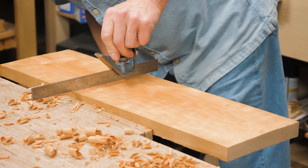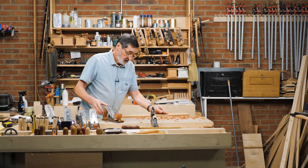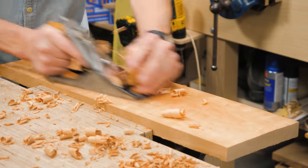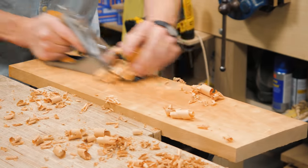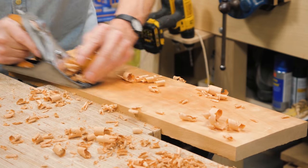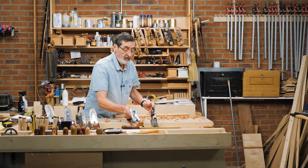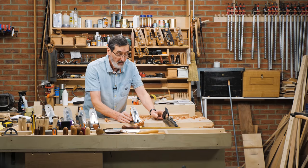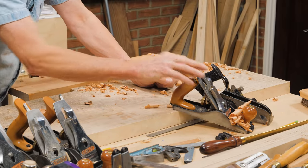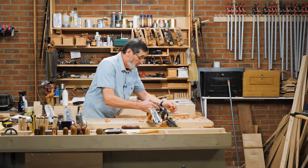Let's take a look at what we've got. I've got very steady undulation across the board. Normally I would go for winding sticks to get this where it needs to be, but in this case I'm just showing you what I do to get my wood close to size. So I'm going through a strategy of planes: the first one I use is the scrub plane, the second is a number four.